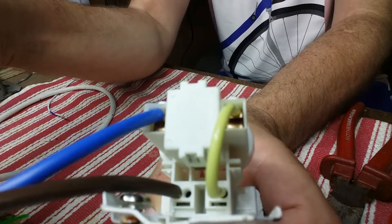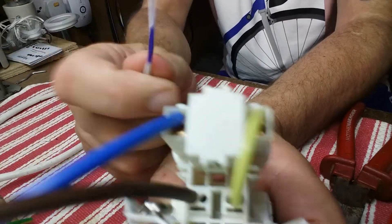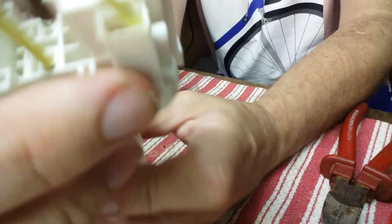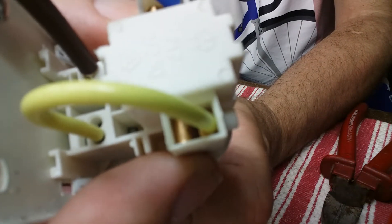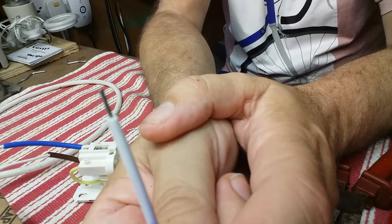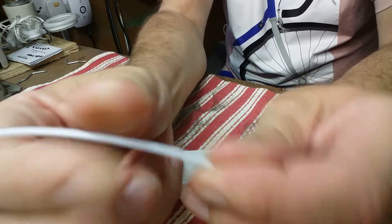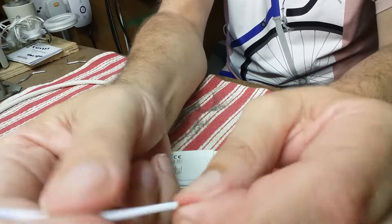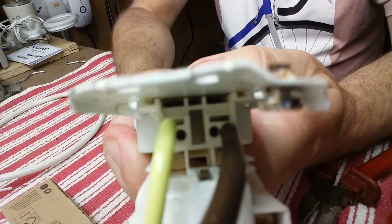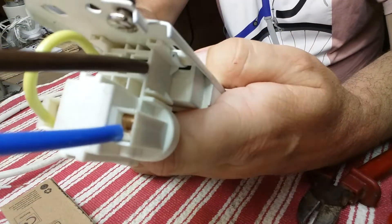The neutral always goes straight to the lamp from the mains input. It's worth noting — if you ever see the neutral go on a ballast, you'll get a bang. These have tiny little push-fit holes that you have to stick a cable into. When using cable, you have to have the stiff kind with hard ends on, because flexible cable will just bung up unless you solder it. The inlets are extremely small — manufacturers saving money — but not always practical when wiring electrical equipment.